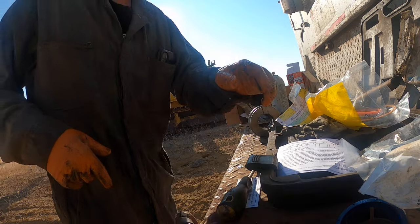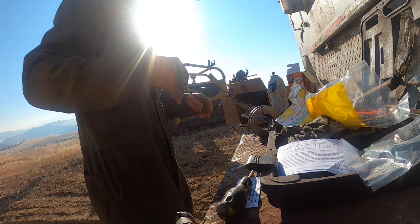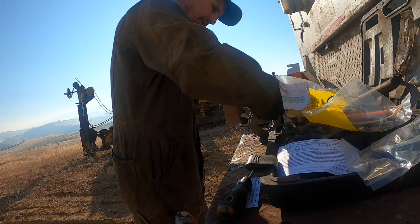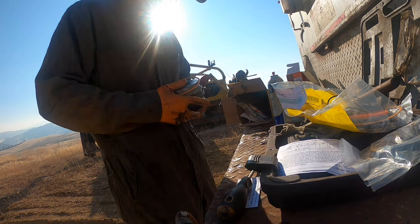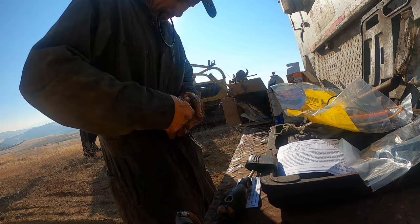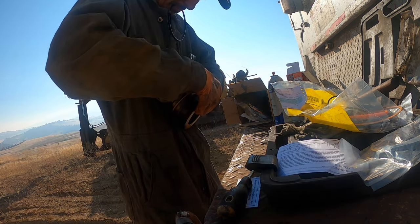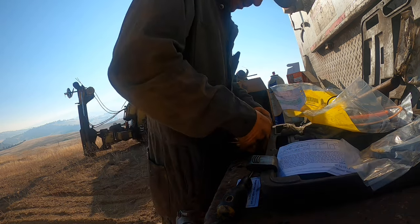It was way wrong. Okay, so I don't see, they're not giving you the gland O-ring there. So they must be using this kit for that part. Goofy, huh? Backup ring, it'll go here. This orange backup ring will go right up here. Okay, gland O-ring.